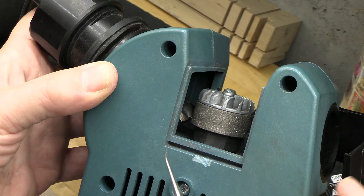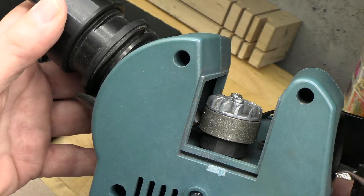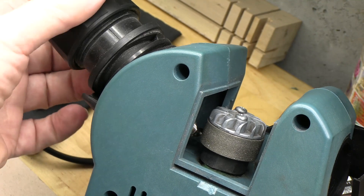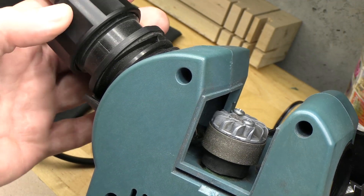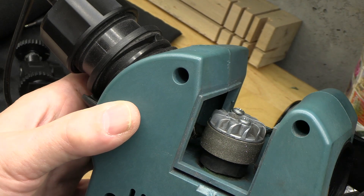This is a good view. When you see the drill bit here and we rotate it, it's actually interacting only with the lower half of the diamond wheel. So what we can do is flip this upside down and give us double the life. Let's look at that.